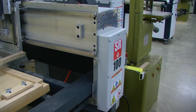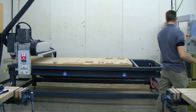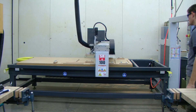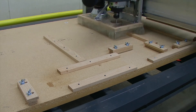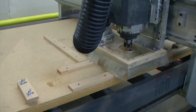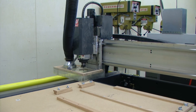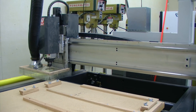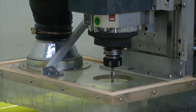The last step is to run our machine through the entire X, Y, and Z axis. It doesn't hurt to run a program as well. On a daily or weekly basis, you should be cleaning the machine with a soft rag, using compressed air to blow off any dirt and debris, and additionally just maintaining the tool holder and spindle.